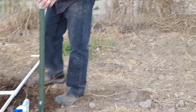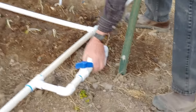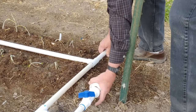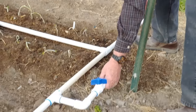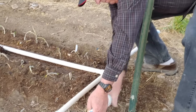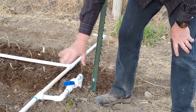Let's get a close-up here of the supply line. This section right to this union is what's left at the end of the season. When I take the system out, these will be taken out of the manifold, this part will be lifted off — that's what's left, and then I bucket it. There's a stake right here to protect it from tilling. When it comes time to set up again, I set in the manifold without the pipes and then simply screw this all together again, and now it is ready to operate. A standard inline valve like this allows me to regulate the volume and somewhat the pressure, because it is a low-pressure system.